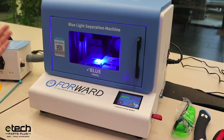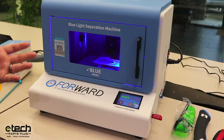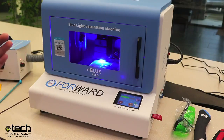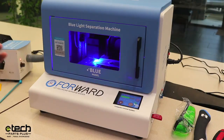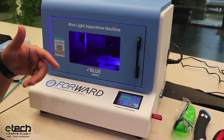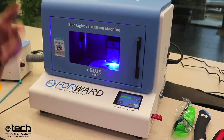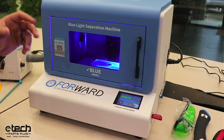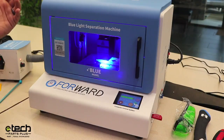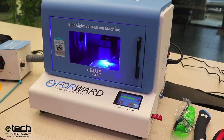It's very rare for a laser to damage a phone, because if you don't have it lined up right, it could hit a cable or maybe the battery area. But the majority of boards are covered by the frame — the light cannot penetrate through metal into the board itself. At most, if it's not calibrated, it might be a charging board you have to replace, or a power flex, which is damaged more often from prying off the glass. It can happen if your laser isn't calibrated correctly, but a lot of these things are avoidable. There's a lot more content available now that helps guide you to prevent those issues.